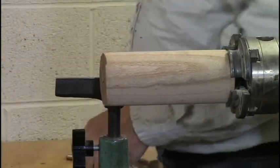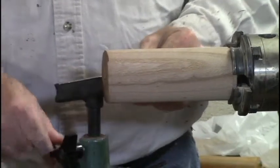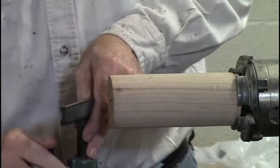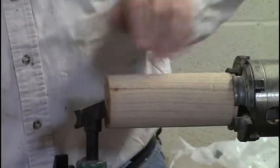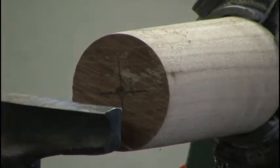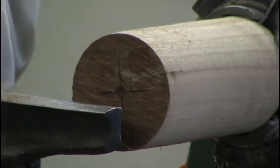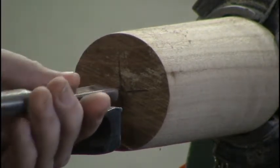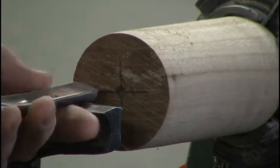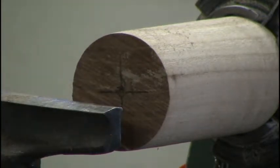Now, to make the bottom — arguably you could use a smaller drill bit and just drill a hole, but you end up with a flat bottom. You could go in with a skew or gouge and hollow out an area to get a nice round interior. It looks really good, and hopefully it'll work out — not too big and not too small.